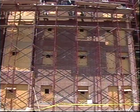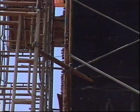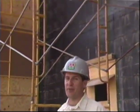Leave ties to the building in place until you're removing the scaffolding on that level, and then make sure that there are an adequate number of ties below you to support the remainder of the structure. There's no percentage in getting rushed and careless. Taking a scaffold down is always faster than putting it up, and you're never wasting time by being careful.